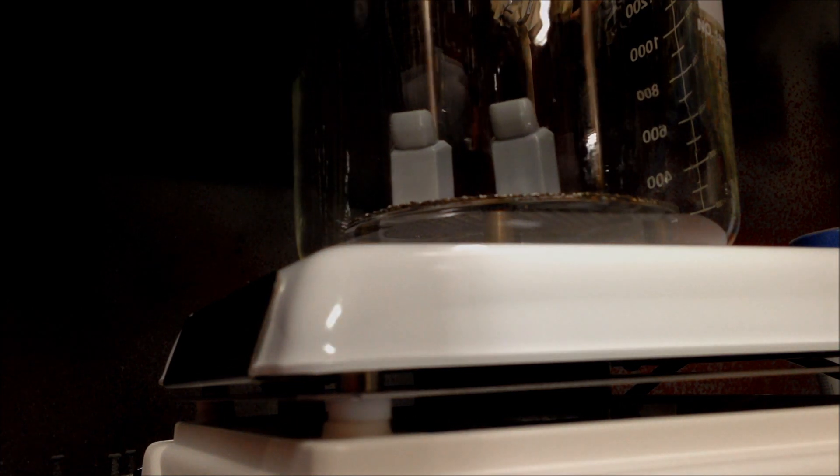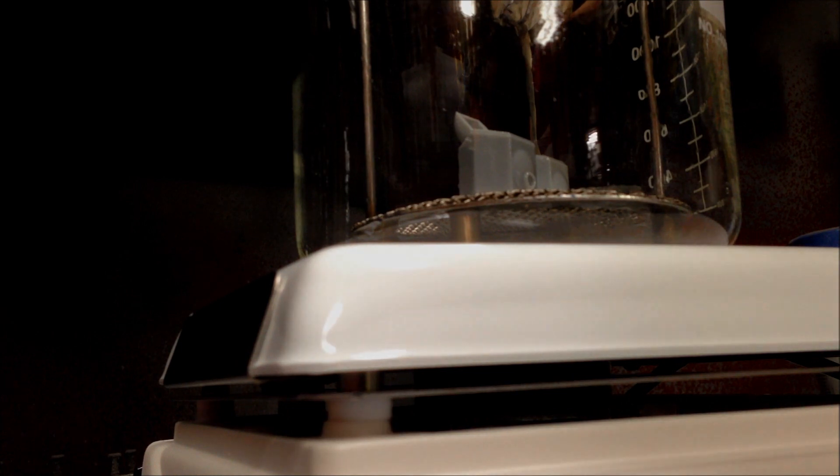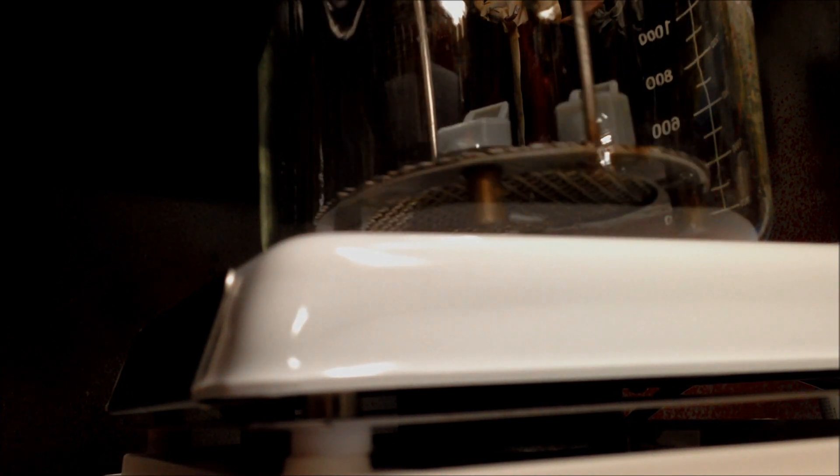What we're doing right now is filling the bottom of the jar with acetone vapors. As long as we don't overheat the acetone, it is heavier and more dense than air, so it'll stay in the jar. Right now I have my mask off for a second to talk and the room doesn't smell like acetone at all — it's all contained. We just want to be mindful not to get it too hot or put too much acetone in at once, to avoid having flammable acetone vapors floating around the room. You can hear it sizzling a little bit when it hits the surface of the jar — we're getting pretty close. It is starting to smooth out; once we build momentum it'll go faster because it'll be warmer and we'll have more acetone vapor built up.